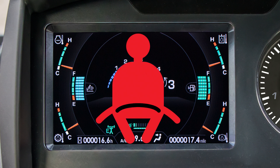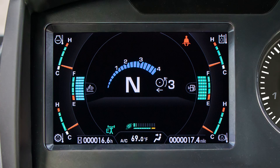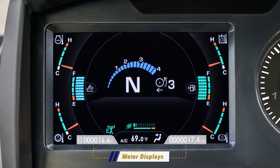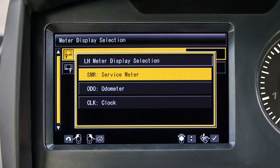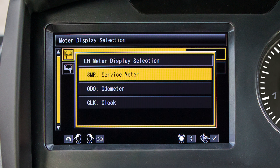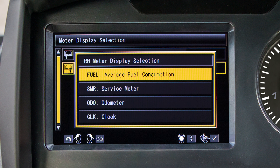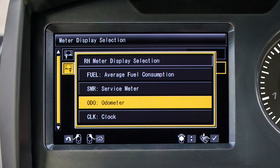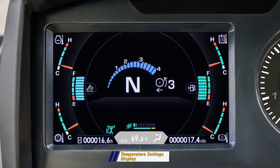At the top right of the monitor display is the seat belt warning lamp. This lamp is lit if the key switch is in the on position and the operator has not fastened the seat belt. The alarm buzzer does not sound during this event. At the bottom of the monitor display, there are two user-programmable meters. The left meter can be programmed to display service meter reading (SMR) in hours, odometer reading, or clock time in 12 or 24 hour format — SMR is the default. For the right meter, the choices are average fuel consumption (the default), SMR hours, odometer, or clock time. Finally, the temperature setting display has been relocated to the bottom center of the color monitor.